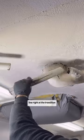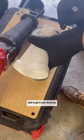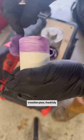Here we have a clogged drain line right at the transition piece. For some reason I thought I was going to be able to spin this off — absolutely zero percent chance of that. So I used a proper copper-to-plastic fernco and was able to get it over the brass transition piece, thankfully.